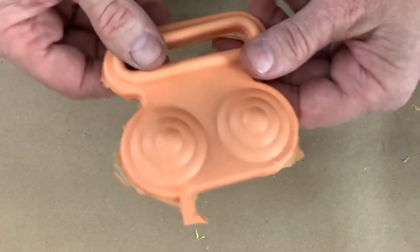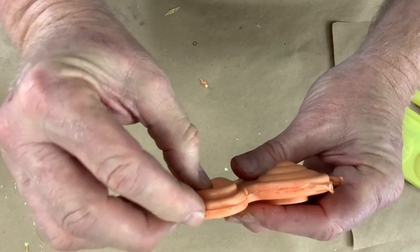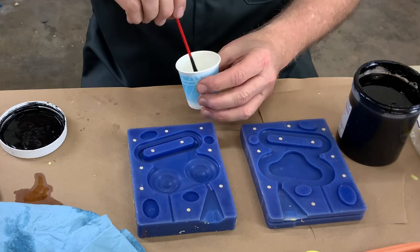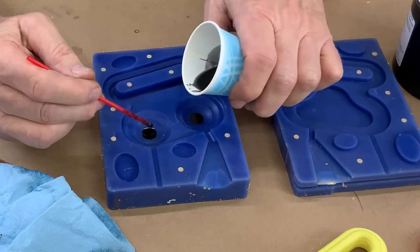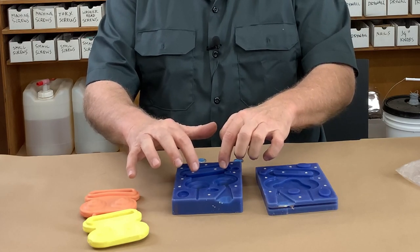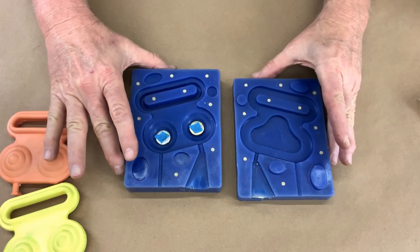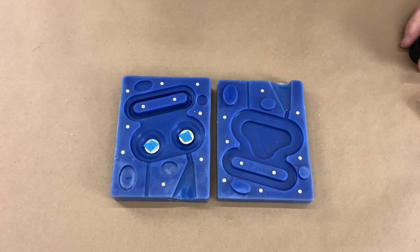Remember Mr. Floppy Face from yesterday? He's rock hard now — I don't think I've ever seen that happen. But look at the edges: there are absolutely no voids. The technique of gasketing works really well. Now, this one we're going to pour in layers — colored resin layers. This is CU pigment. I poured the black eyeballs and then realized I hadn't put spray release on the molds, but I don't want to put release on the black eyeballs because I want them to bond with the other layers. So I just took a couple of little washers and placed them down inside those eyeballs — anything under the washers won't get spray release. These are wax molds; the resin shouldn't stick to the wax anyway.